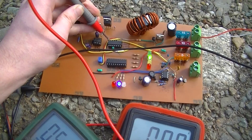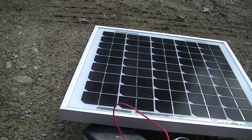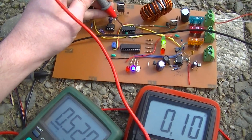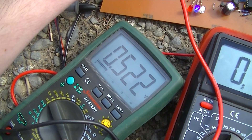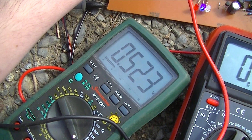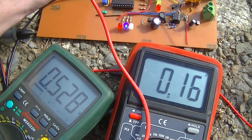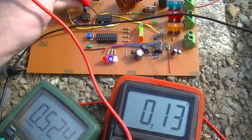I'm still not really getting any current gain, but I'm attributing that to the array being too small, because MPPT charge controllers generally work with fairly decent-sized arrays. There's also the signal from the ACS713 — which is the meter on the left — is minimal, so there's not much for the algorithm to really track. Again, the array being too small.